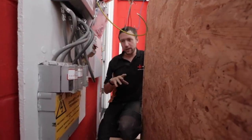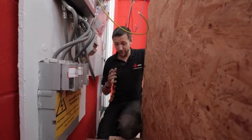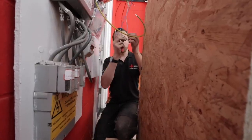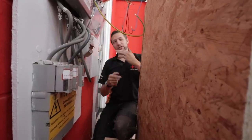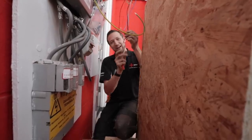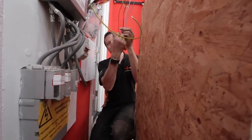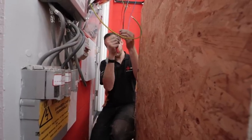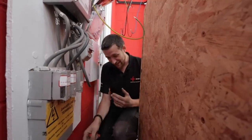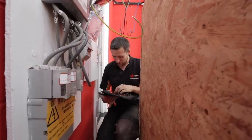One thing — if you're working with cables all lying around the fuse board, I've done it loads in my career. This is why I leave them all bent up like this if I'm working down here. I've done it before loads of times — just left them straight and of course you poke your eye out with it, hurts like fuck. So just leave them bent up so that when you're working in that area you don't hurt yourself. I know it sounds like a silly thing, but it took me a few attempts before my thick head got the message.